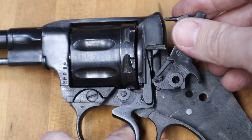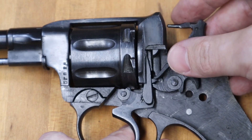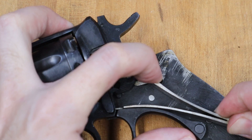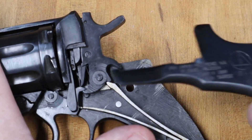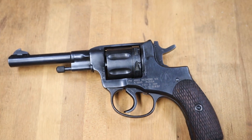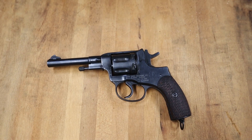In conclusion, both the support block and the hand are used in conjunction to push the cylinder forward, but the delicate hand, which is directly connected to the trigger, doesn't bear much of the forces, if any. And that's how the Russian 1895 Nagant revolver and its gas seal work.